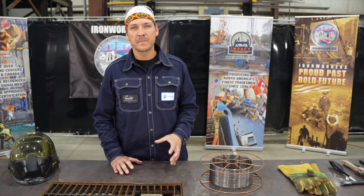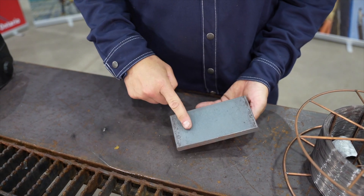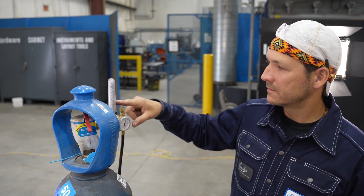One of your best defenses against moisture in your filler wire is to wrap it and keep it stored properly. When it comes to your material, if your material is thick enough, you may have to put some preheat into it. Having fresh gas and making sure that it is not too old can also be a good defense against worm tracks.